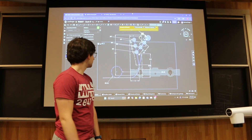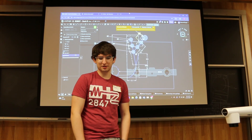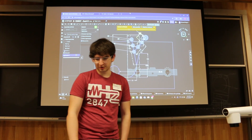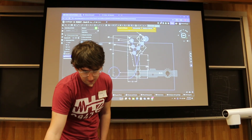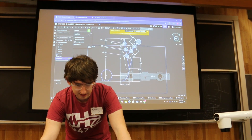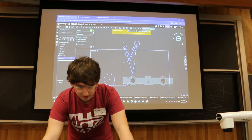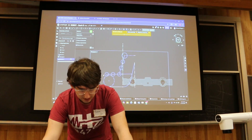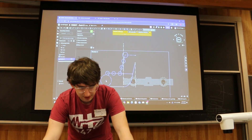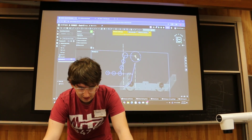This is our intake. We were challenged with a small space to build it in, with obstacles, while wanting to extend as far out from the robot as possible. We played around with different mechanisms and came up with this idea: it starts in a stowed position, still under 22 inches so it can go under the trench. When we're ready to deploy it, it goes outward until both arms are parallel, compressing the ball enough to bring it up through the chute and into our indexer.